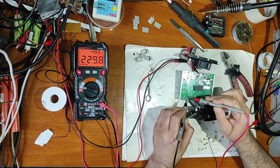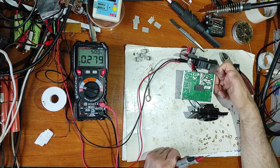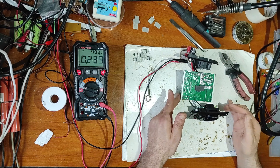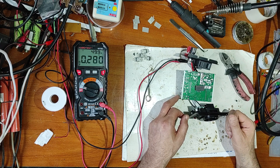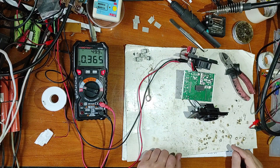Let's move to AC and measure the output voltage - it's good. Frequency is good. Let's check if these transistors are hot - they are a little hot. I cannot make a full power test without the MOSFETs on a heat sink, but everything seems good.